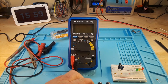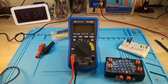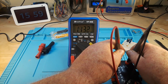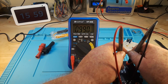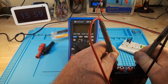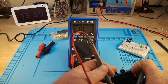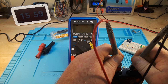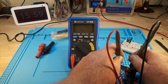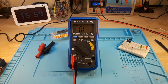What do you say we start with resistance today? We'll start high with 1 meg — 0.99, pretty good. 10k — 10.01, pretty good. 1k — nothing bad to say there. 2.2 — 2.4, okay. Very good on resistance readings, no problems whatsoever.